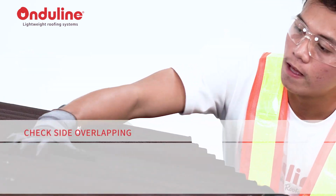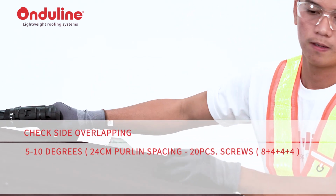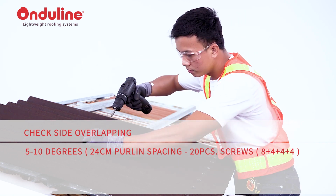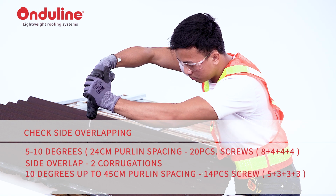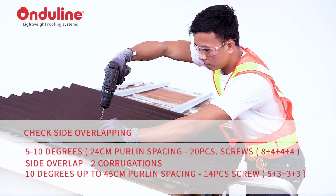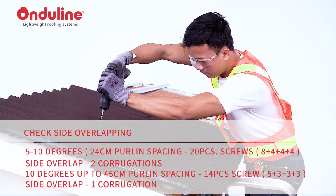Check side overlapping. 5 to 10 degrees or a 24 centimeter purlin spacing: 20 pieces screws of an 8x4x4x4, side overlap, 2 corrugations. 10 degrees up to 45 centimeter purlin spacing: 14 pieces of screws of a 5x3x3x3, side overlap, 1 corrugation.